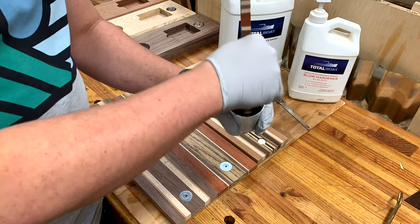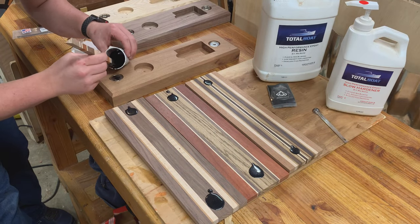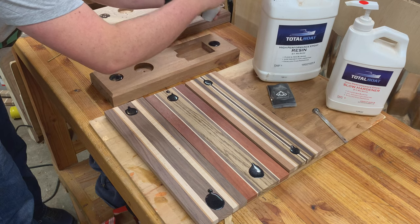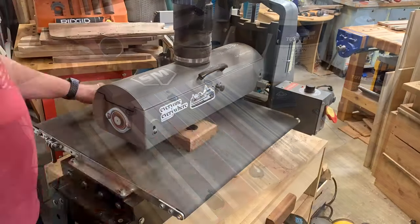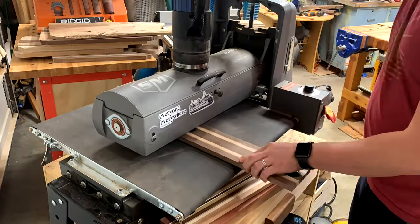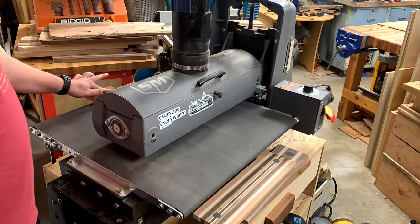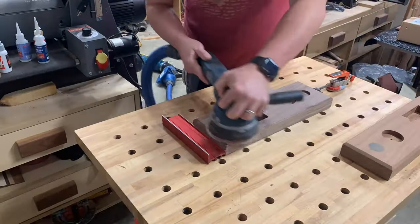If you're going to do washers, the hole just has to sit a little bit low, and you can cover it with epoxy. You can certainly fill the spots with five-minute epoxy, but I like to use Total Boat two-to-one, throw in some black pigment — it adds a really cool effect and ensures the magnets never come out; it looks a little classier. Afterwards, you'll need to surface it — you don't need a drum sander, just an orbital sander to smooth it out and get it nice and flat. That little circle just looks kind of cool.